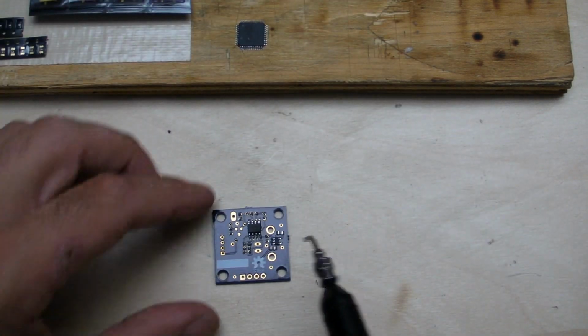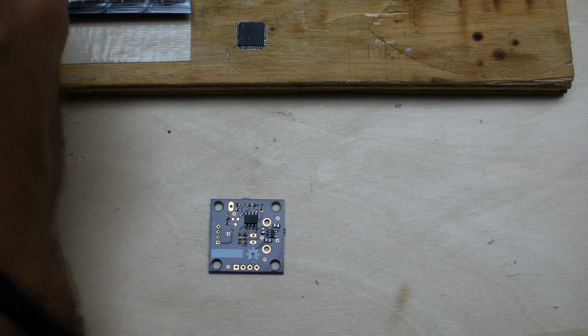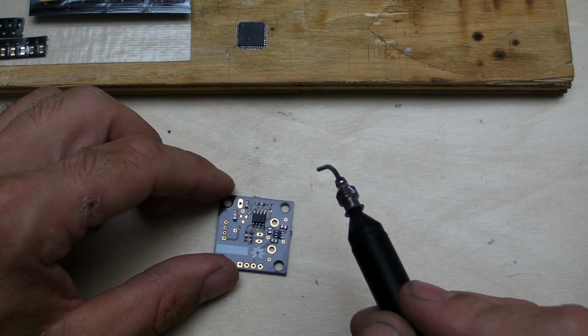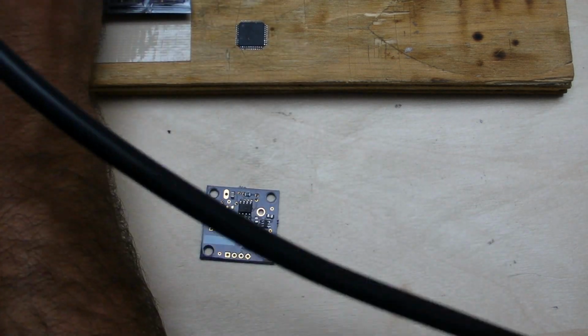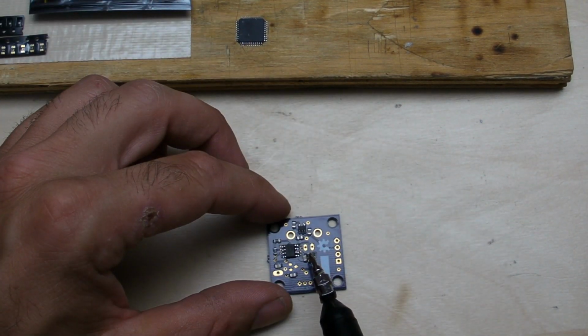One more of those. This is next to the op amp, just to give it a little extra. Then we have a 10 UF general bypass to make sure we have enough supply capacitance on the back side here. And then a couple of higher frequency bypass capacitors. Then there's one on the op amp input, just to make sure it's got enough AC decoupling across that. And then we can put in some of our gain circuit. There, and there's another one of those right there. And there is a third right in the middle here.